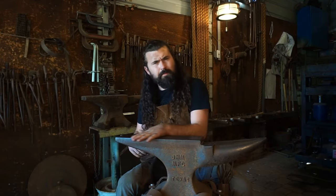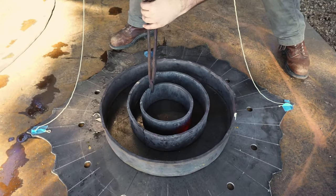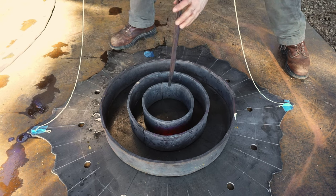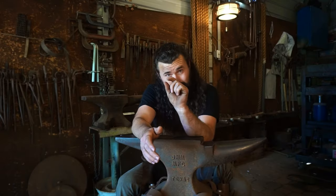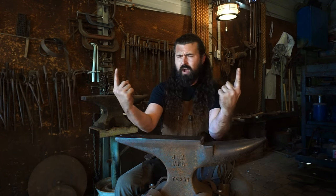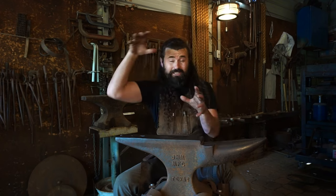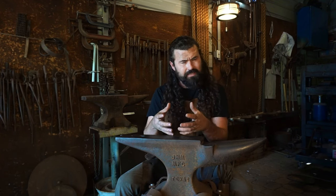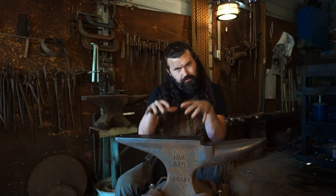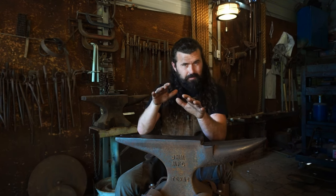You might be asking yourself, why am I making these rings on the bottom? The rings are to add structural rigidity to the plates themselves. It might seem like a lot with three-eighths plate — you couldn't imagine that bending in a big hub formation. But when you have 5,000 pounds of tree 12 feet up, that's a lot of lever on the top side of that plate. So those rings are welded into place, which pretty much makes that three-eighths plate into four inches.